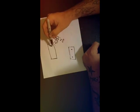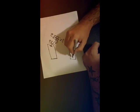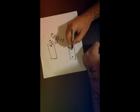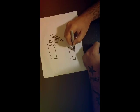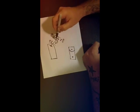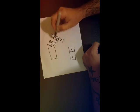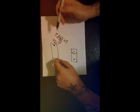So the hole that's going to go to the ear is going to be 3/8, and of course I do have to ream it out with a burr cutter to make it 10 millimeter. This hole here, I need a pilot hole because I've got to use a hole saw to get the radius to fit on the tube. So what I like to do, I like to go slightly larger than the tube, so when I put the tab on, I have an air gap there. It helps you when you weld it.